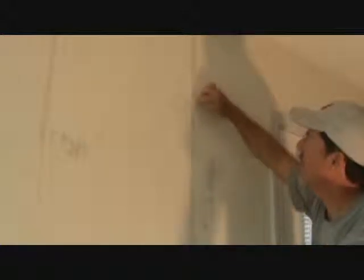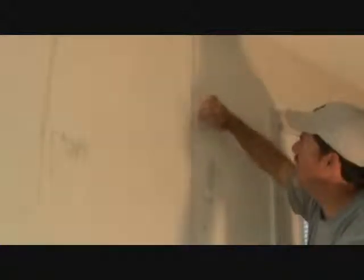If that crack was a joint between two pieces of sheetrock, then I would have to put tape, because if I put mud right over that it's just gonna crack out again. With this particular area it won't, because it's only surface damage.